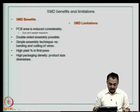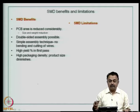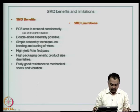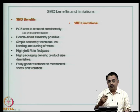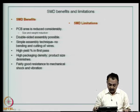Because you are using surface mount devices, obviously the packaging density is very high and product size is reduced. If this is going into a product, you can imagine the size reduction compared to a through-hole system level printed wiring board. The devices are fairly resistant to mechanical shock and vibration because you can imagine that through-holes through which components are inserted can experience continuous shock and the reliability of copper plating is at stake. We will discuss this again in this module.